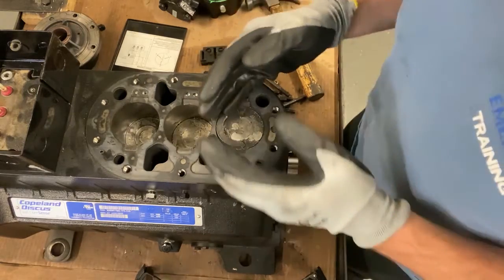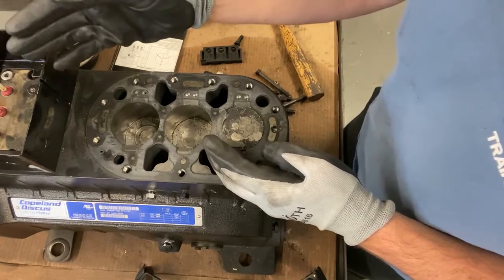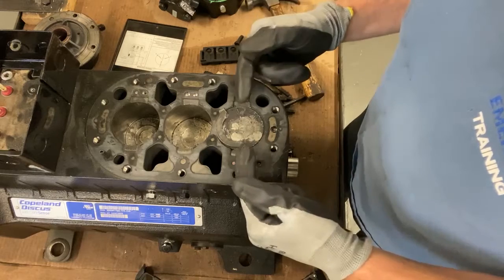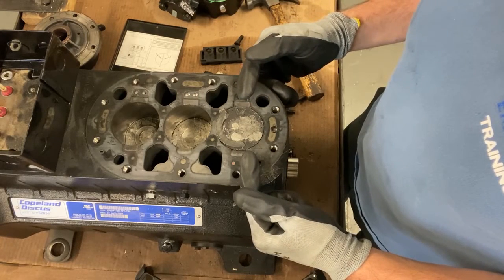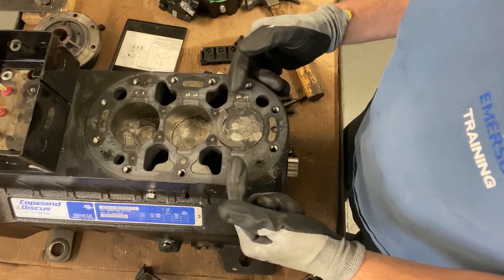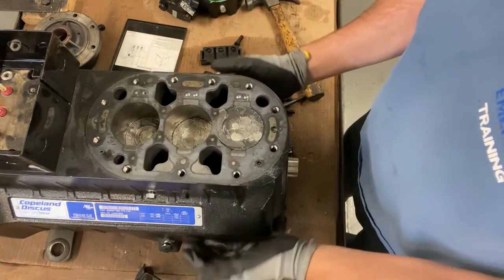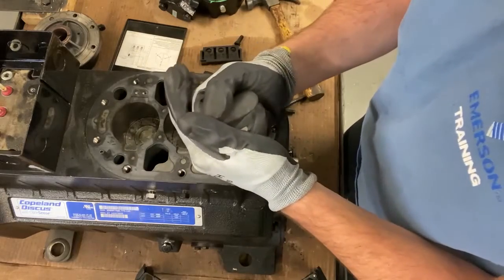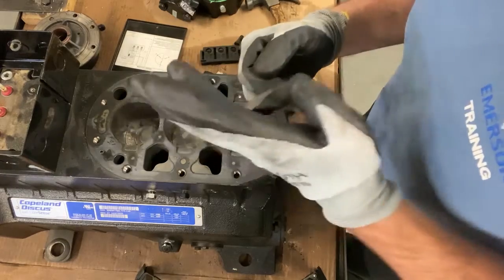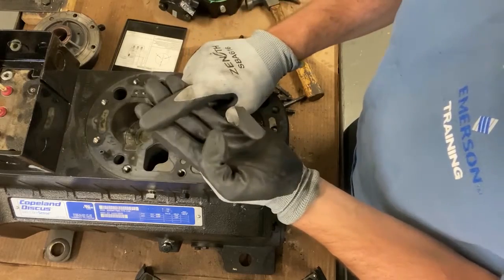And now let's talk about what happened here. We got an electrical failure. Yes, the compressor's not going to start, electrical failure, but we have that electrical failure because of a slug. And that slug was due to what? Migration. System migration. That refrigerant migrated back to here, filled up inside the compressor. The compressor started up, and refrigerant-cooled compressors, when you have a massive flooded start, takes a slug. So there's three things. Electrical was caused by a flooded start, which had a slug.